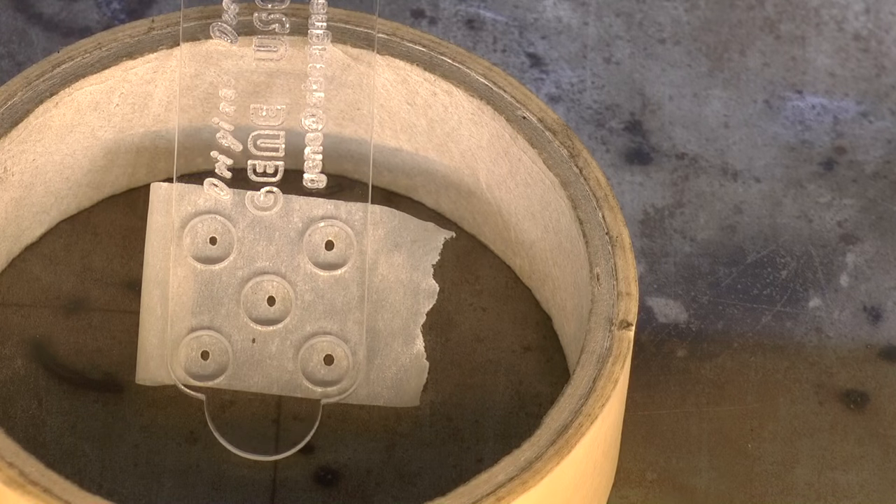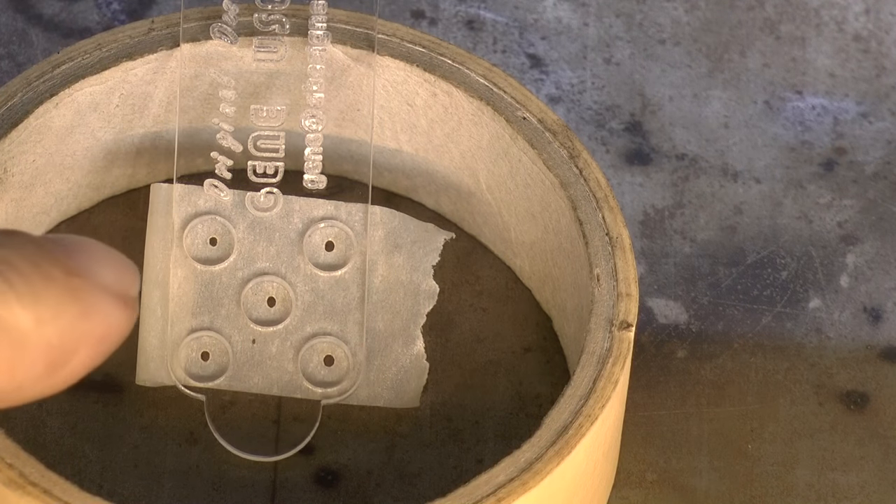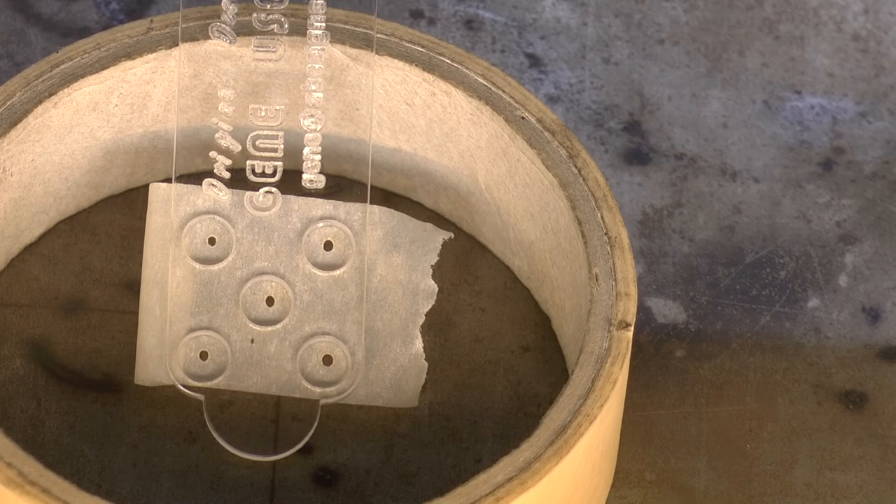Let's take a quick look at these results. The good news is it doesn't look as though there's anything seriously wrong with the alignment of the axes because the beam is pretty central — not perfect, but pretty central across all parts of the machine. As we can see with the bottom-left and bottom-right there's a slight off-center in the opposite direction, but I certainly wouldn't be worried about this for general use. This is why I'm calling this device a laser thermometer — it gives you a very quick health check of what your machine is doing.